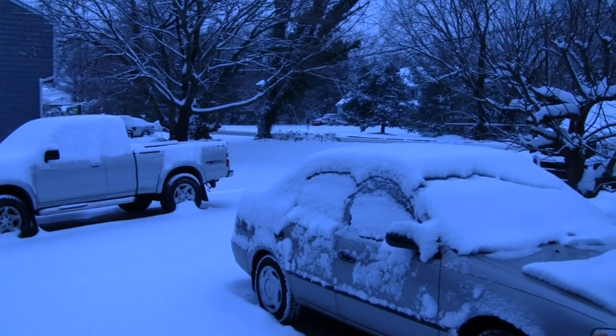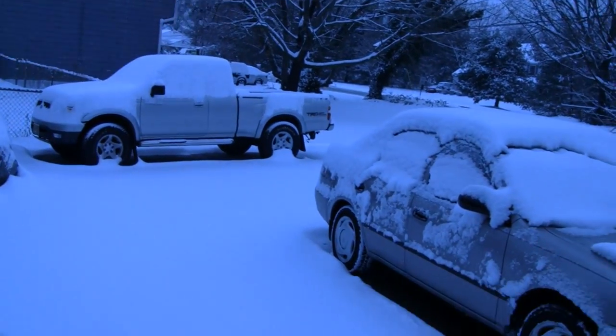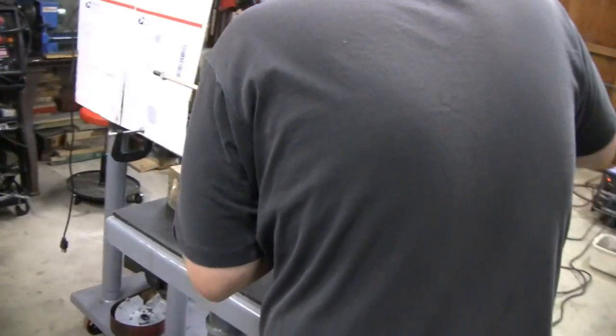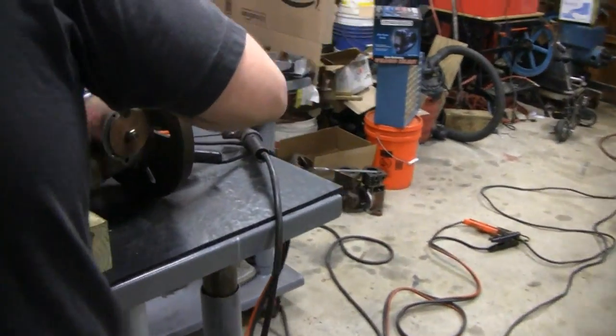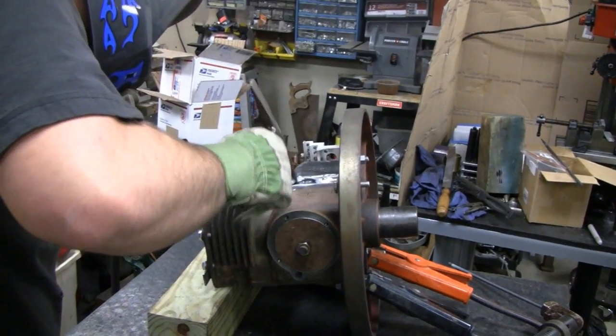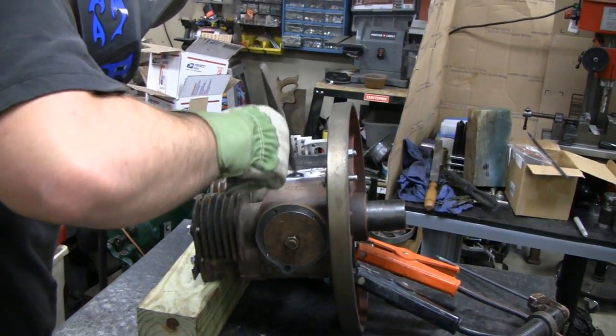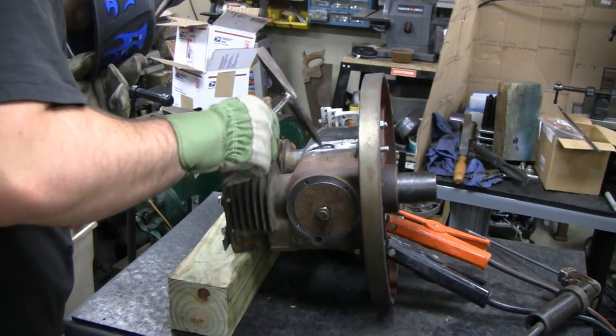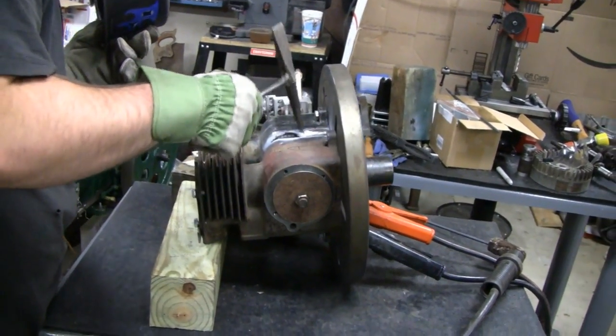Alright, we're going to get back to Mike and let him start welding. Alright, I feel like I'm in Canada. Mike is going. Watch your eyes, I don't want you guys to hurt your eyes on there. That's why I let Mike do my welding — he knows what he's doing. What he's doing is he's only welding about an inch at a time and then peening it over. This rod they tell you not to preheat. You don't have to preheat. So we're going to try and see if it works that way. Usually we'll preheat it, and if we have to we will, but we're going to see how this stuff acts.